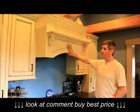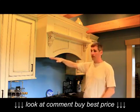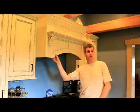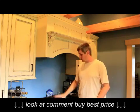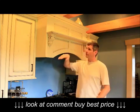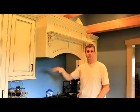The M-Series hood comes typically in whatever width and height you want. It's going to be driven by the distance from the bottom of the range hood to the counter. Most building codes and fire codes in most states and townships require 30 inches. If you get closer than 30 inches, you may fail fire code because you're too close to a combustible surface. So make sure you think about that — that's going to dictate your height. In our case here, we've got a 24-inch high range hood because of the height of our adjacent wall cabinets, to leave us with 30 inches below.